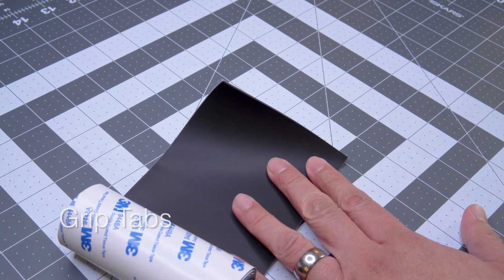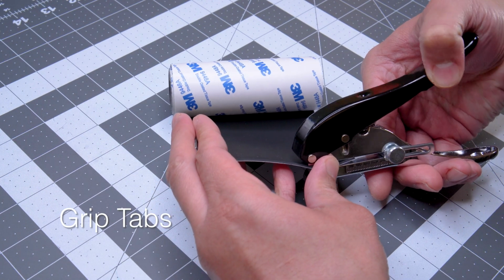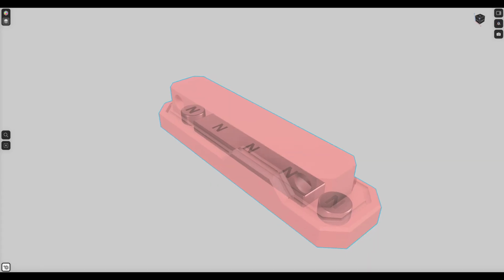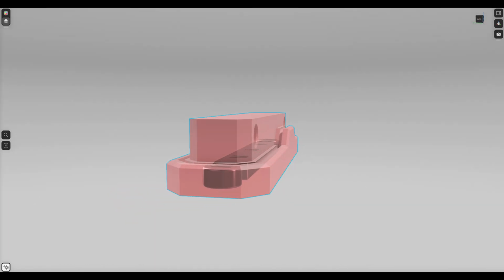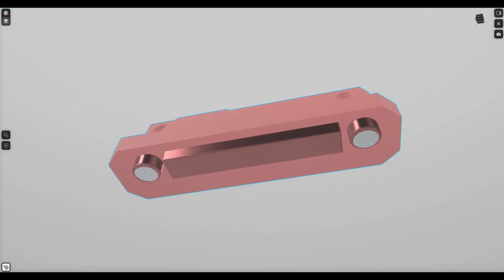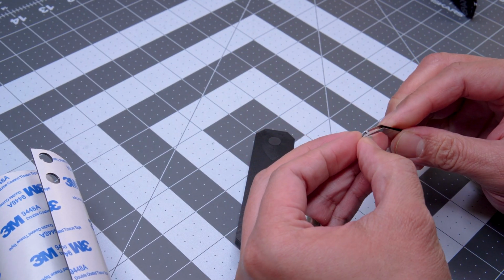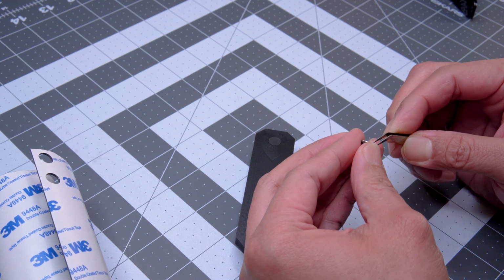And last but not least, the magnetic base has been revised to incorporate two 8 mm wide silicone dots to help with grip on vertical surfaces. The recesses for the grip dots were designed so that they allowed them to protrude only a fraction of a millimeter beyond the bottom surface of the base. The round magnets immediately adjacent are set as low as possible to maximize magnetic force. This means the grip dots attach directly to the magnets.